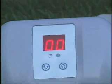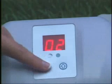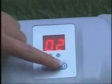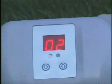Now you are ready to set the timer. See the table in the manual for recommended hours of operation according to the size of your pool. Press the up button once for every hour desired and the down button to reduce the number of hours if needed. When the proper number of hours is shown on the LED panel, lock the control by pressing the down button until a long beep is heard, then press and hold the up button until another long beep is heard. The control is now locked and a green light will come on in 3 or 4 minutes indicating chlorine is being generated.